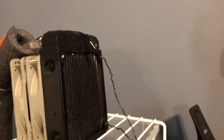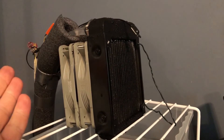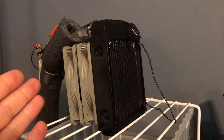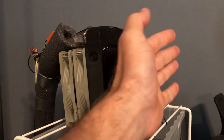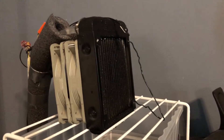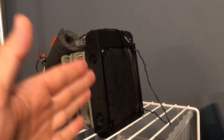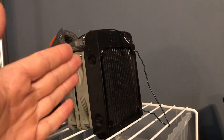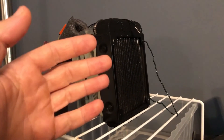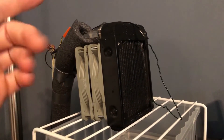As I've shown in this video, this little 120-millimeter PC desktop heat exchanger with 12-volt fans and a chest freezer set up with a pump is capable of cooling an entire room and keeping it cool even in summer temperatures. It pumps out nice cool air right over the bed — very nice and cool to sleep in at night. There is one important thing I want to leave you with: do not pump a super-cooled fluid through the heat exchanger. By 'super-cooled fluid' I mean taking something like windshield washer fluid, an alcohol solution, or antifreeze and putting it in the chest freezer.